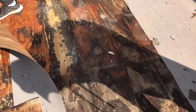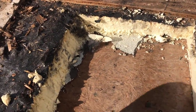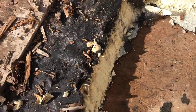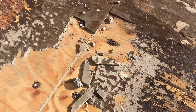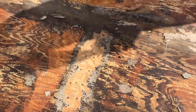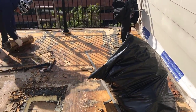We have a lot of moisture underneath this Duradec membrane. The plywood's completely warped. There's a tapered insulation system underneath a half inch sheet of plywood, and the problem is that it's completely soaked, with water actually on the OSB below. All the joints are rusted — they didn't use the proper fasteners — but beyond that, it shouldn't have had that much water sitting on it. All of the plywood at all the joints is curved downwards because the insulation got wet underneath and it warped all the plywood. So it just has to come up in its entirety, including the tapered insulation.